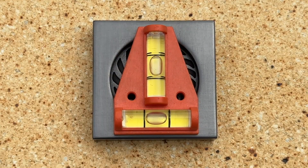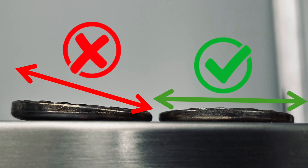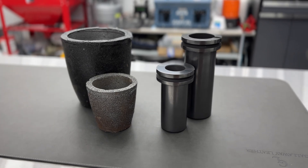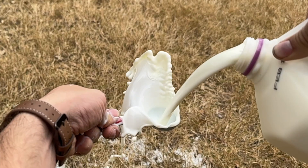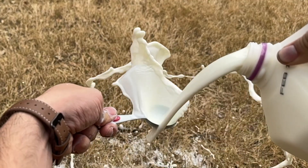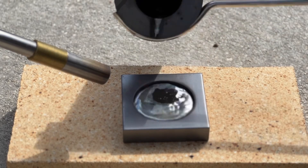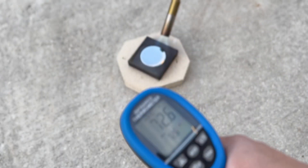Before adding heat to your mold, it's imperative that the mold is level. Otherwise, your coins may turn out lopsided and uneven. Next, be sure to pour with a small crucible when casting coins. Just like you wouldn't pour a gallon of milk into a tiny teaspoon, you certainly wouldn't want to do it with molten metal. Small and controlled pours are the key to successful coin mold casting.